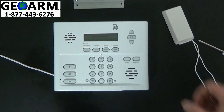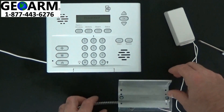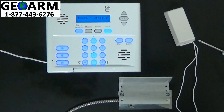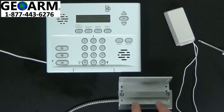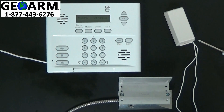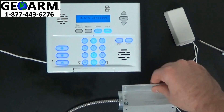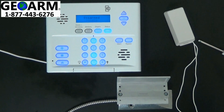Now this should be all ready to go for testing. I'm going to put the magnet and the contact right here so that you can see it. Now I'm going to arm the system up — doors and windows on — and the system will go through its arming process. The system is armed up. Now I'm going to show you that this external contact is working — I'm going to remove the contact, the alarm should go off. Alarm cancelled — which it has. That's how you wire an external contact into the GE Simon XT using the 60-362N-10-319.5.